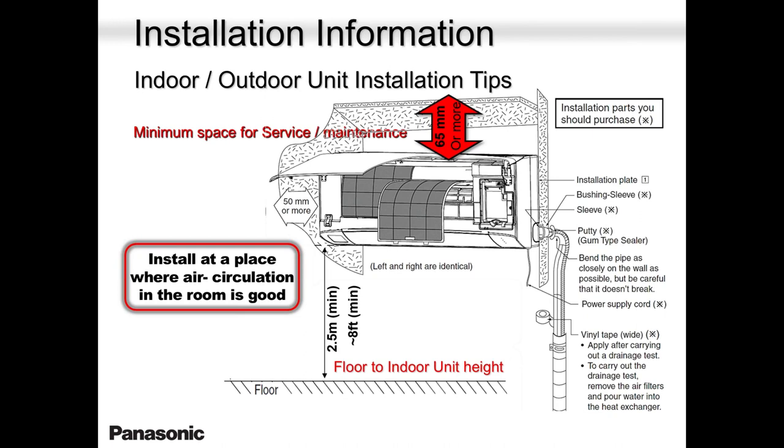That means in most cases, that hot return air, or that warm return air, got trapped over here, putting that unit to sleep outside, telling the compressor, hey, I'm satisfied. Meanwhile, the sitting area is cold. So always keep enough room at the top. And if there is a side wall here, then move the unit more towards the left, so that it has enough room to return here, as well as the side section.